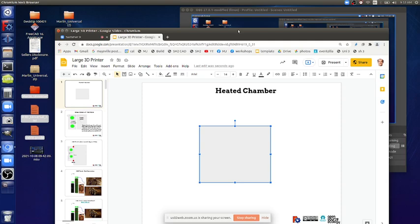And what's the thought on the Z axis? As soon as we can mount the Z axis, we can start controlling it. The thing to figure out there is whether one motor is going to be able to support the whole weight and move it up and down effectively. The one thing to change there is that we have spring steel wire that we can use as an artificial counterweight. You would wind this spring steel wire around the rod, so when it drops, it has bounce back.